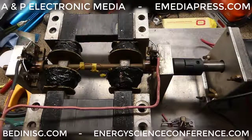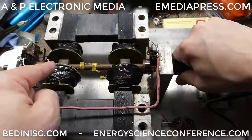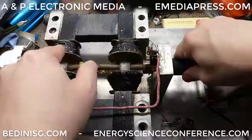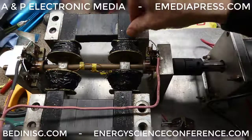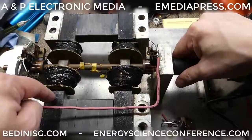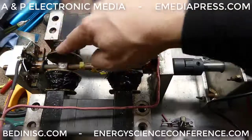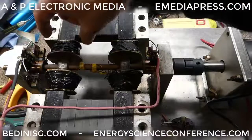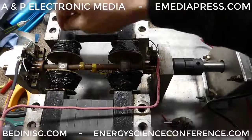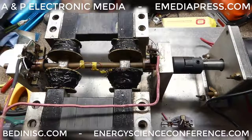One thing I just wanted to walk through is John's build here. These are coned because if you had the full circumference at this end, when it comes here it's going to hit. He did it that way so he can have a pretty tight gap. These gaps are actually not highly accurate — they're a little bit tighter on this side than this side — but the point is you want the gaps to be as tight as possible. If you have coils with the same diameter at both ends, you need a pole sticking out so the edge of the spool doesn't clip your iron laminates.